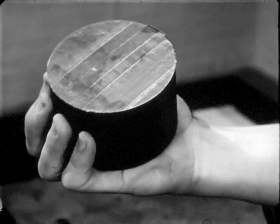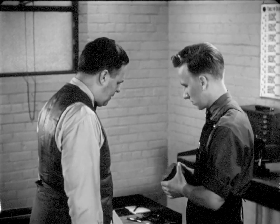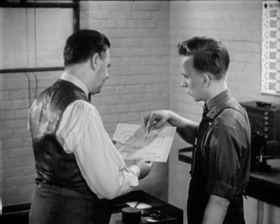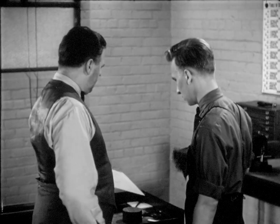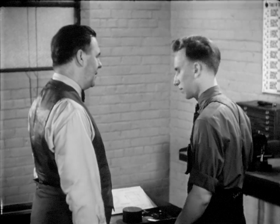The gear starts out as rough stock, which must be drilled, bored, and reamed to exact size on a lathe. Looks like an internal taper and a gear blank. That's right. I'll have to use the reamer for the finished cut. Yes. You've got some close tolerance to see. Get your reamer and other tools from the tool crib. All right, I'll get it set up right away. That's fine.